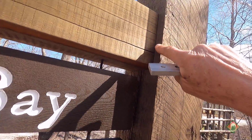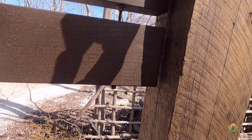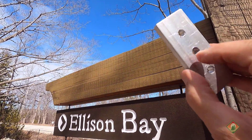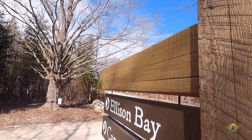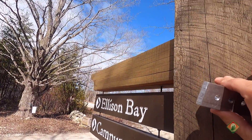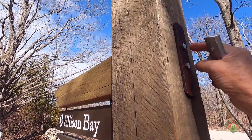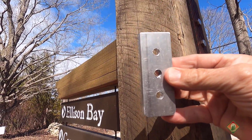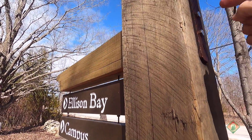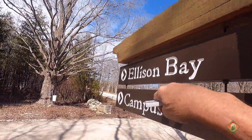On this side, we routered in a mortise — we would mount a mortise just to match that. The stainless steel or aluminum got mounted on here permanently using that upper hole and a lower hole. But the inside hole was threaded with a 3/8 inch. We decided to go double on those because of the cantilever. We probably made a five-hole version, used two to fasten it in, and two on the other side. Those bolts go through — I know those are stainless steel — and that cantilevers and holds everything up.